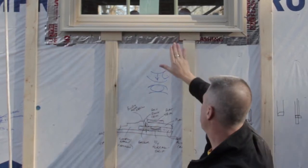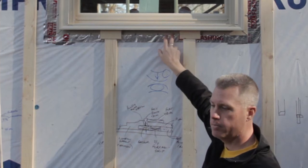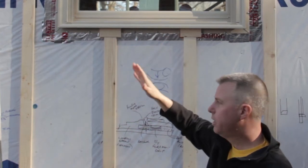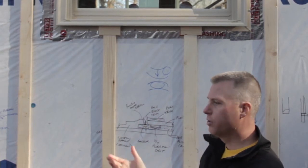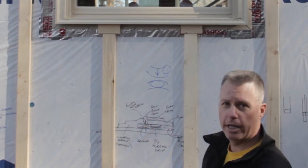You want to tape it before that, and put a little bit of sealer behind it as well — a nice latex or something that's going to be both waterproof as well as able to move around, since in a tiny house the structure is basically going to be rattling down the road, over the occasional rough driveway or other conditions that may apply.